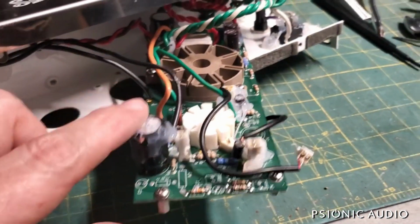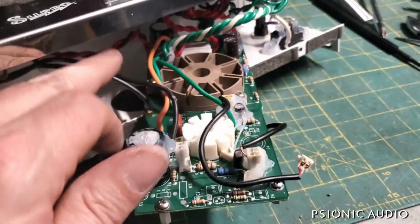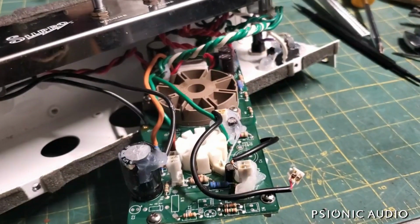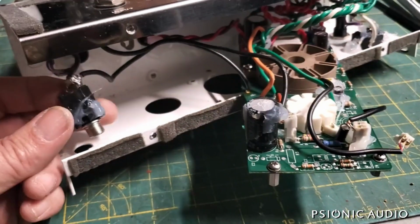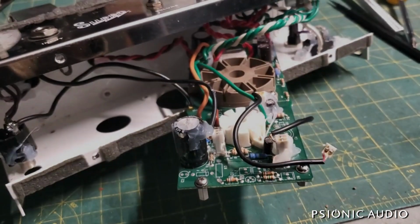So let me clean these solder joints up and give some actual reinforcement for these two caps here and here, which have the wobbles. And I'll put a 47 microfarad F&T where the bad cap was. Put it all back together without the globs and globs of glue. Pointless, really. And we'll see how it's sounding and operating at that point.